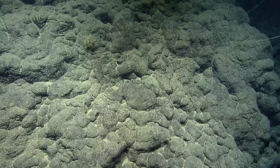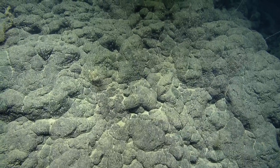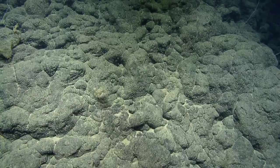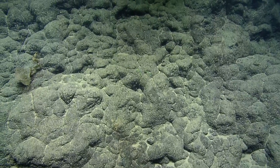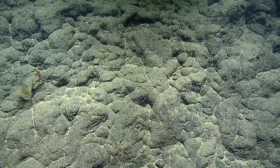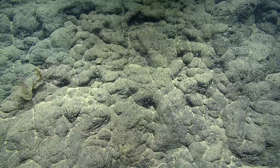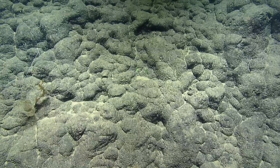Another thing we do is we add extra oil to our hydraulic reservoirs, because at depth, oil compresses. So we lose some of our oomph in our hydraulic functions. We increase the oil at the surface so that when it compresses, we don't lose too much at deeper depths.